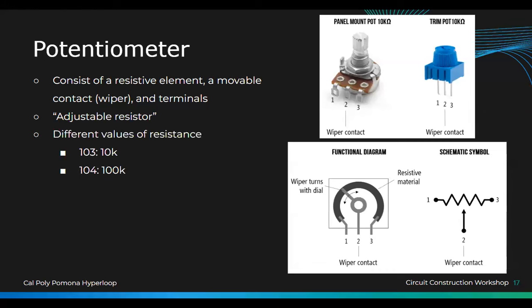So that means that when the arrow is pointing here, it's zero, and then the resistance changes up to 100, so it's 0 to 100. The arrow can differ depending on how you wire it, so it can be either this way or this way. The maximum value that you can hit is 100K or 10K. This is the most common way to do it.